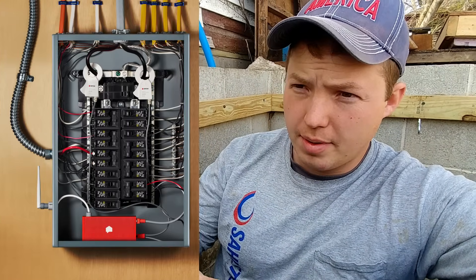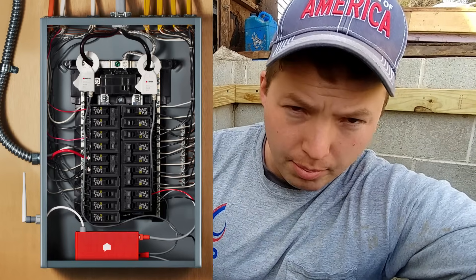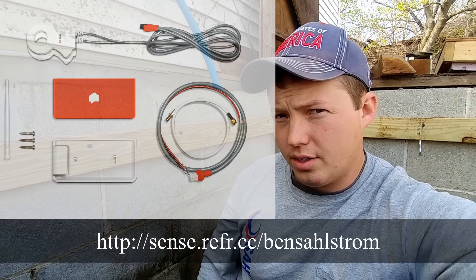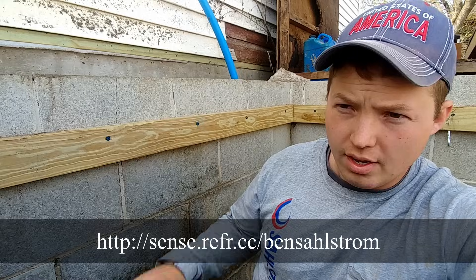My watch just told me that my well pump came on — that's probably my favorite feature of the Sense energy monitor, which you can customize to give you alerts for specific appliances when they're turned on or if they've run for a certain amount of time. The way I have it set up with my well pump is that when the pump comes on it sends me a notification, or if it's been running for longer than 10 minutes it will also notify me. In my mind, if the well has been running for 10 minutes straight, there's a chance something weird is up — someone's running water, the kids left the garden hose on outside, or there's a big leak somewhere. I'll put a link in the description where you can get a discount on the Sense energy monitor. It's one of the more practical and useful things I've invested in — being able to keep a close eye on power usage and what's going on at your house is really worth a lot.